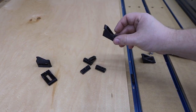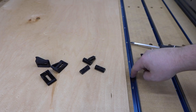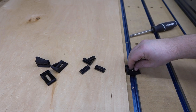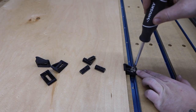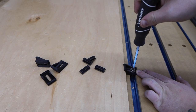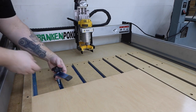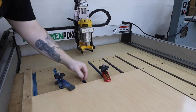When it comes to clamps, I'm a huge fan of these toe clamps from PwnCNC. They just sent me some of these metal T-slot nuts that allow you to use a regular 1/4-20 bolt and make for a super secure low profile clamp. There are a lot of other style clamps you can use — this style Powertech and Incra Hold Down are popular, but it's important to remember they require a lot of clearance so you don't crash your bit or dust boot into them.